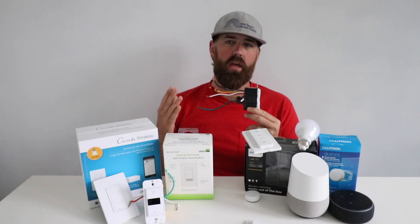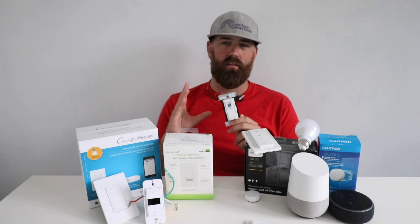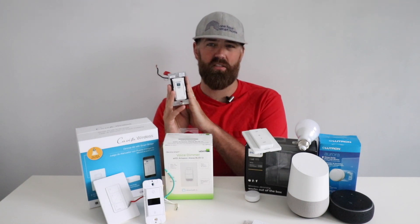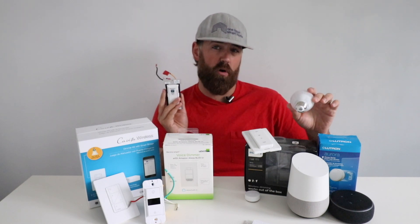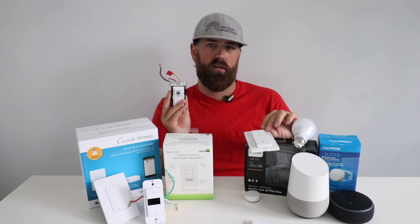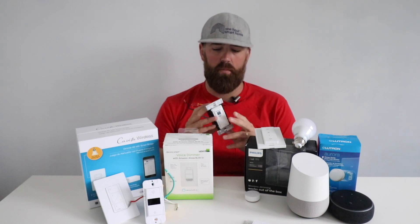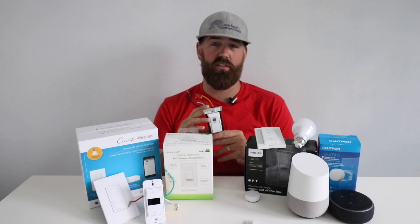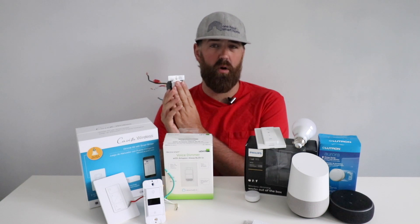What is nice about a Wi-Fi light switch is, let's say you have a series of light fixtures controlled by one switch — four or five light fixtures controlled all by one light switch. You put this Wi-Fi light switch in and it will control all of those, so you only have the cost of the Wi-Fi light switch versus the cost of multiple smart light bulbs plus a wireless light switch and the Philips Hue hub. Most Wi-Fi light switches don't require a hub — they connect directly to your Wi-Fi router.